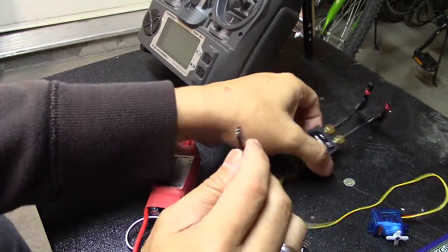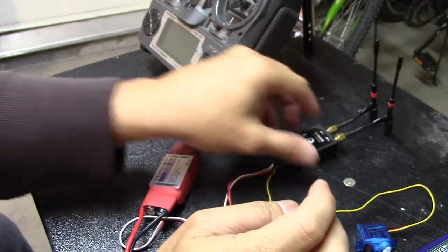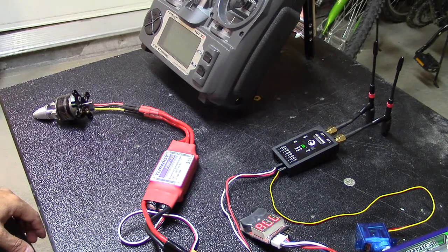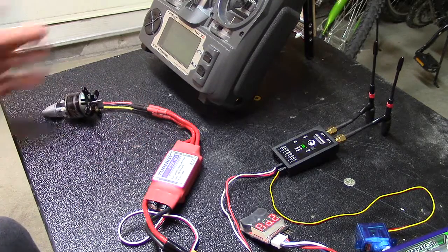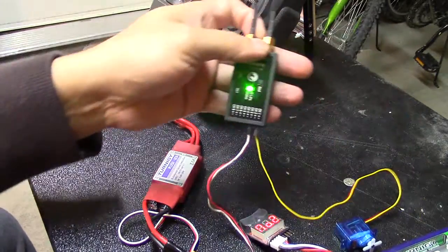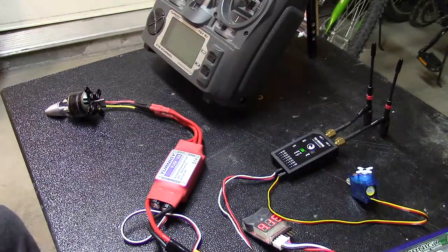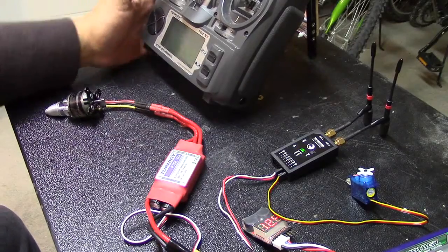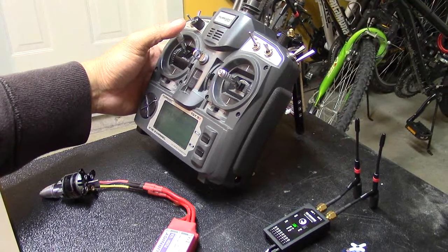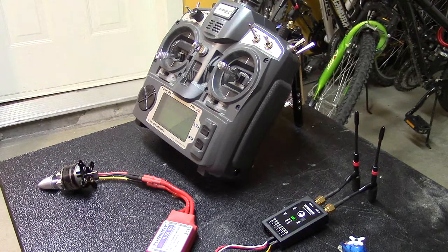What we're going to do is plug the servo signal wire to channel 3, and then I'll put power on. You'll notice the motor keeps beeping and will not arm. Channel one on the receiver is ailerons — it moves fine. But channel 3 has no signal. I thought it might be reversed, but nope — no signal.